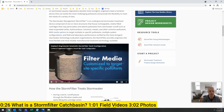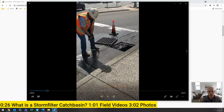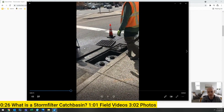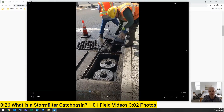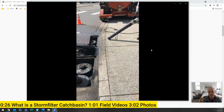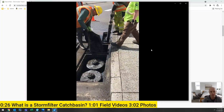The outsides and the top of these, especially the very bottom area, these areas are going to be the dirtiest. The first thing you're going to want to do to clean out the cartridges is pull off the bolt cover lid. You can see he's pulling this off and pulling it out onto the road — a little scary for traffic control. This facility still has the sediment trap or inlet protection inside. This is the first time it's ever been cleaned out, and that should have been pulled out after construction was done.